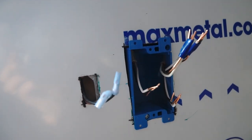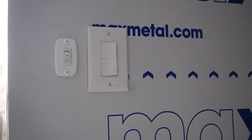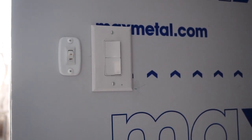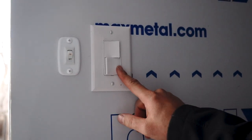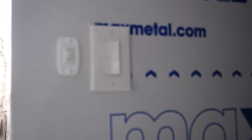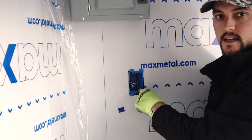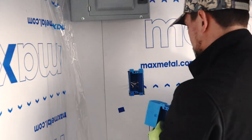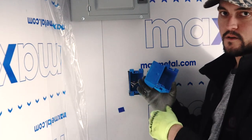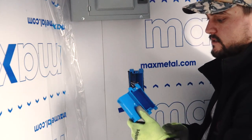The wires tuck in back there so I can get them all wired together, and then my switch fits in really nicely. Here's a look at the final product - my toggle switch for exterior lights and interior lights, and then the 12-volt on/off for the two dome lights. A pretty slick little box. I'm going to use this same style box for my other GFCI outlet too - I decided it was worth pulling the outlet out completely and replacing that box with one of these.